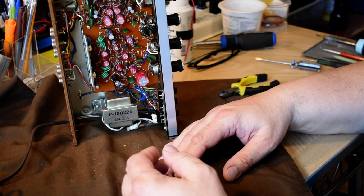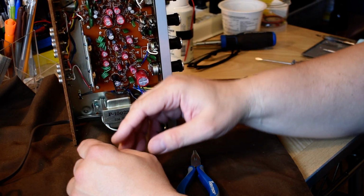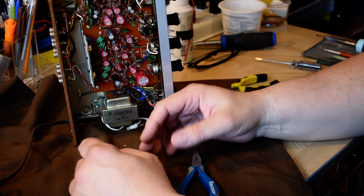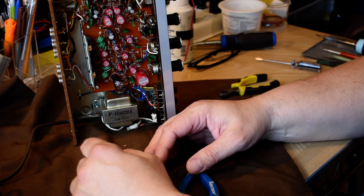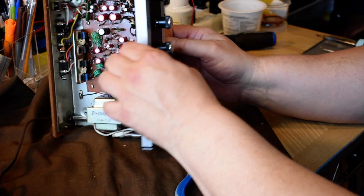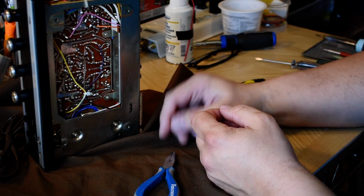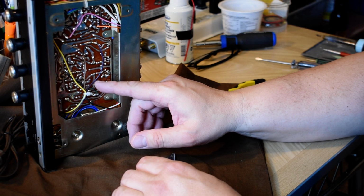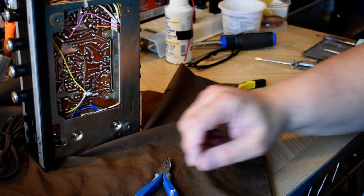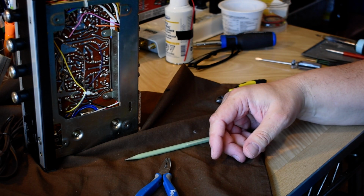I had a Heathkit tuner, a solid-state one of the smaller ones from 1965. One of the output transistors was bad, and it's just a low-level output. So I soldered a new one in and put one in on the other channel, plus a couple of caps. Turn it on, and I've got noise on both channels, but where did the FM go? It was because I was soldering up in there, and one little dribble caught near an IF can. It was bridging some pins of one of the IF stages. I looked, and there it is. I cleared it, and the FM came back on.